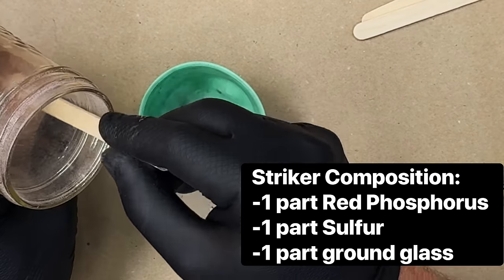What is this stuff? I'm going to try to do this quickly. Ammonium perchlorate is the oxidizer. Zinc oxide is a smoke colorant. It's dispersed like a very fine white powder. Hexachloroethane is a smoke generator. Ammonium chloride, smoke generator. Sodium bicarbonate, a buffer. It's actually used to aerate the whole mix, which is really interesting. So it's an optional component, but I'll get back to sodium bicarbonate in a second. Sulfur, which is a fuel, and ferric oxide, which is a catalyst.